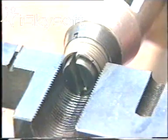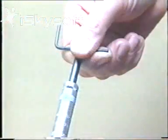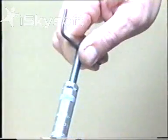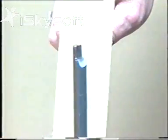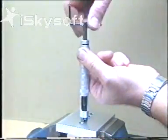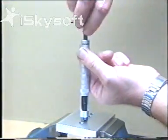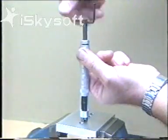If this happens, pull back slightly on the tool to reduce the weight on the tang. Don't use the tool to break the tang by turning the mandrel backward — it will break off the tang and break the tool. Fine pitched tools have threaded mandrels which unscrew out. They may seem a pain to remove, but they do guarantee the insert does not cross pitch.